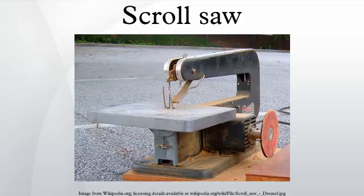The rigid arm scroll saw was popular until the 1970s but is no longer made. It has a single-piece cast iron frame. The blade is attached to a Pittman arm on the bottom, which pulls the blade down. A spring in the upper arm pulls the blade back up again. This design has a significant weakness in that the tension on the blade changes with every stroke. Modern scroll saws are all constant tension designs.